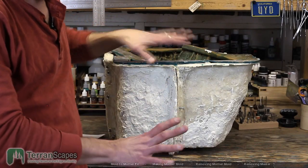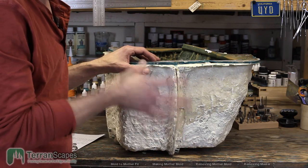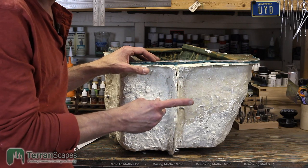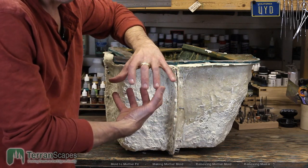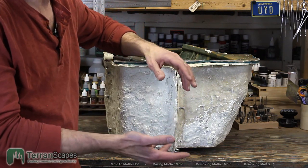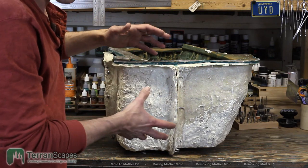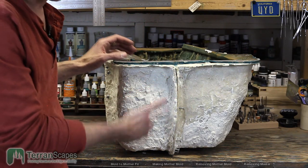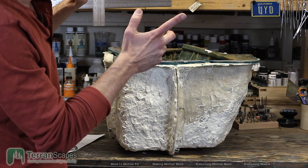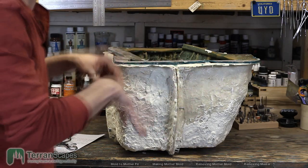So those made a huge difference, and having them now going forward, I feel much more confident about using one part molds, for instance, to encapsulate an object, and then be able to get in there with a good clean line to free it, rather than taking the time to make two part molds, for instance. So there's a lot of flexibility it provides when you're a single caster and you're not in a studio with other people who can assist you while you're doing those kinds of cuts. And it just feels good to be like, I'm doing surgery.